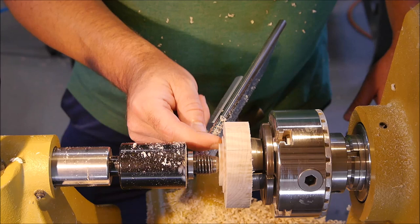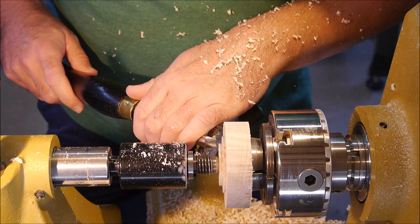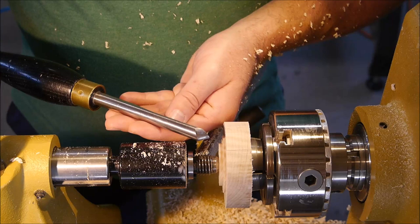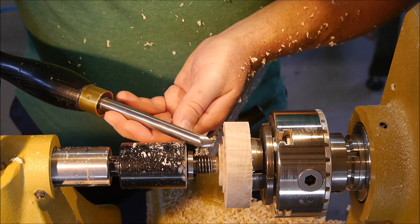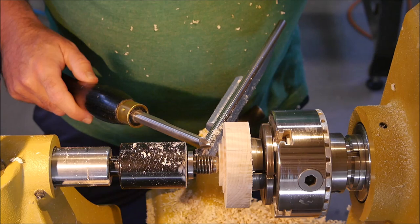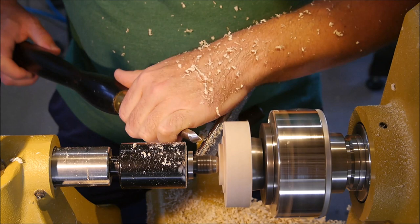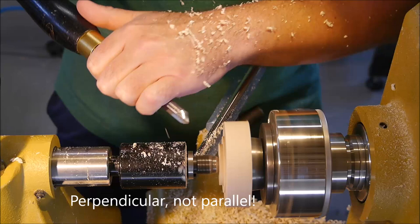I'm almost down to the diameter, leaving just enough room for the spindle gouge cuts. Now I'm going to make a series of cuts to create that flat shoulder area for the top of the jaws — same cut coming in like this. Now I've got that second step that will be the area for the top of the jaws to rest on. To clean everything up I'll switch to my spindle gouge and make a couple of cuts to match the dovetail angle. The spindle gouge cuts in the direction the bevel points, so I kick it out slightly to copy the dovetail angle going in, then roll it over with the bevel parallel to the lathe axis to cut the flat surface for the top of the jaws.